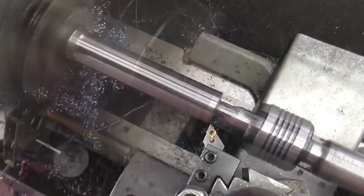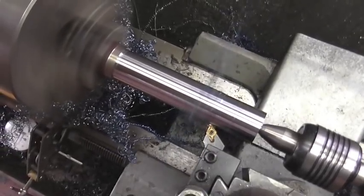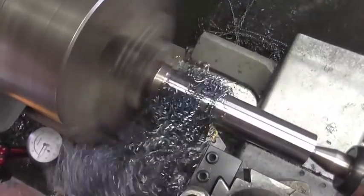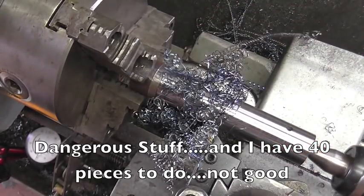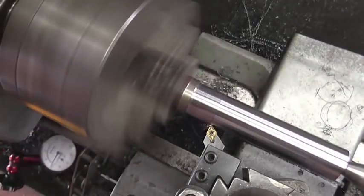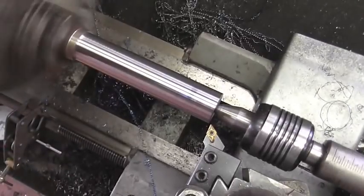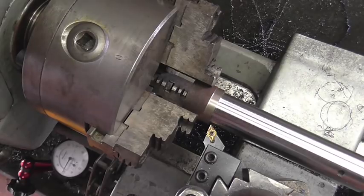Always at the end. I still can't take any more than ten thousandths per cut, but now I'm turning twice as quick. This job is going to be the end of me. It's pretty hard to catch the carriage before I hit my stop over here, so I think I'm going to increase that margin to a hundred thousandths.